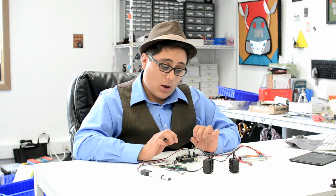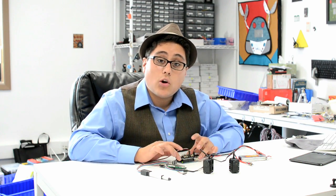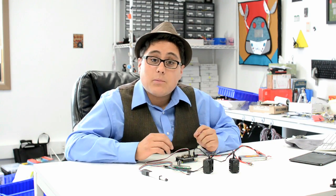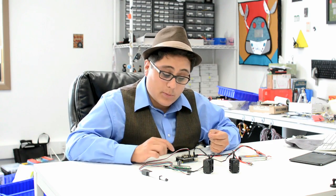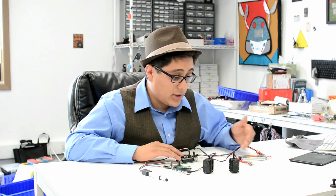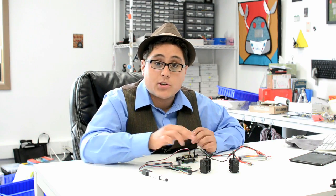You have to be really careful when working with these jumpers. Make sure you're only plugging in devices you know can handle different power supplies. Actuators are okay, but an LED board or other sensor boards might not accept five volts and you could damage them if your jumper is set the wrong way. You also have to be careful not to plug in too much voltage — say 12 volts — to a servo that might only take six or seven. You might damage it.